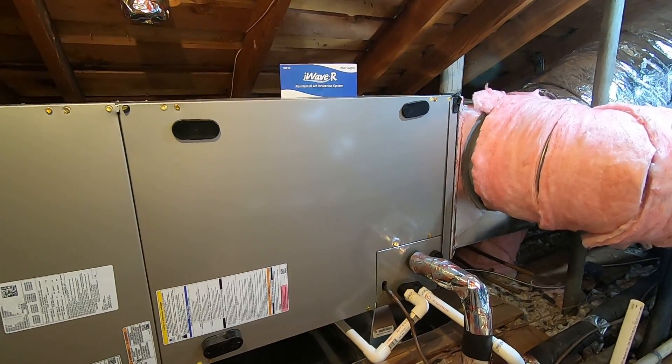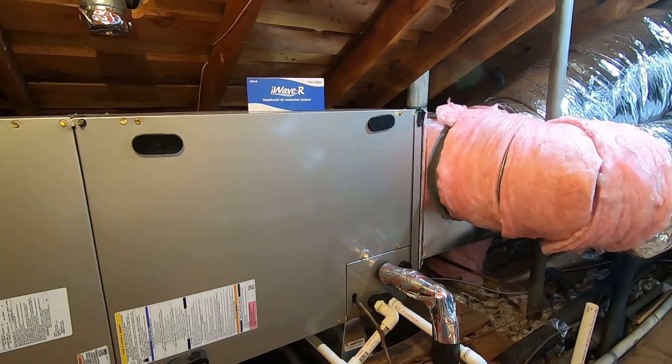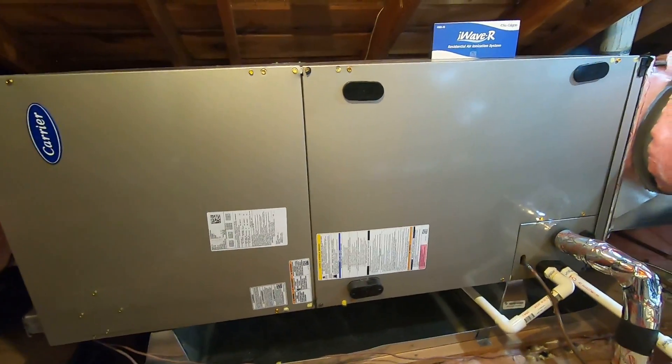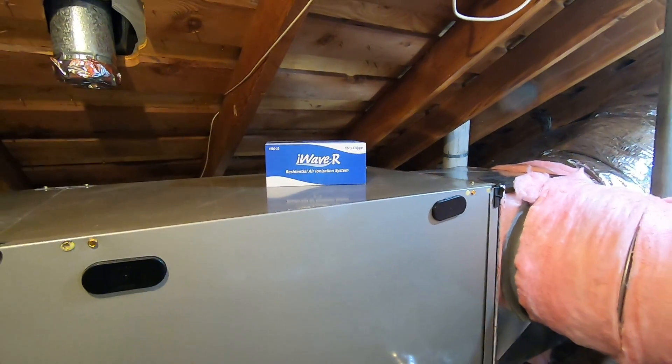This unit needs a dedicated 240-volt circuit with a maximum 15-amp two-pole breaker in the panel. On this installation we ran number 12 wire because it was about 45 feet away from the panel. That goes to the disconnect switch on the front of the unit, which is a 220 switch that powers the fan coil.